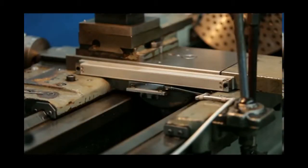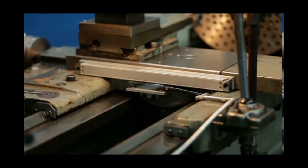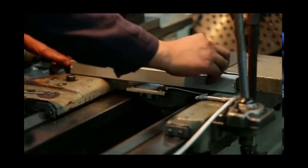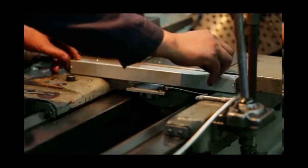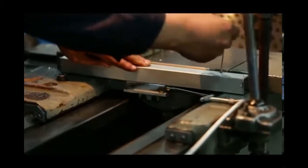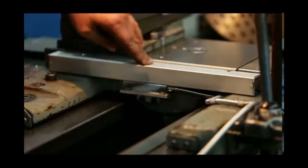After fixing the bracket, we also need to calibrate the readhead. Please pay attention: the plane of the readhead needs to be about 1mm lower than the scale, and the distance between the readhead and the scale should remain approximately 1mm equally from left to right. This calibration only applies to the DC-10F model. The next step is to install the cover. Since the hole on the pad strip is already prepared, we just fasten the screw.